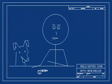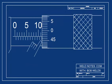Okay, there's just one more small concept and we'll be done. What if one of the marks is just barely showing? Do you count it? Is it ready to be used? Here is the trick. Don't look at the mark to find out whether the mark is showing or not. Look at the thimble. You need to know if a new mark is starting or if an old mark is ending. In this example, look at how big the number on the thimble is.